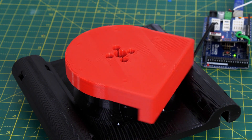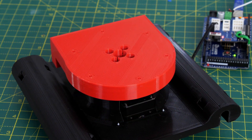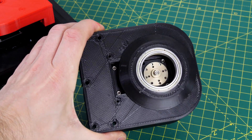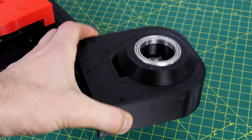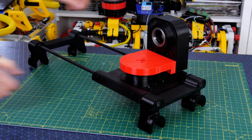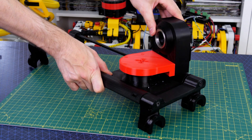Let's do a quick test — we can see that rotates, and this servo will actually do 360 degrees. The next stage uses another servo and a similar bearing so we can mount this stage on the previous red stage to make the second axis. With both stages assembled we can fit that onto the rack which fits on top of the dog, and we can see at least the first stage rotates freely with no obstructions.